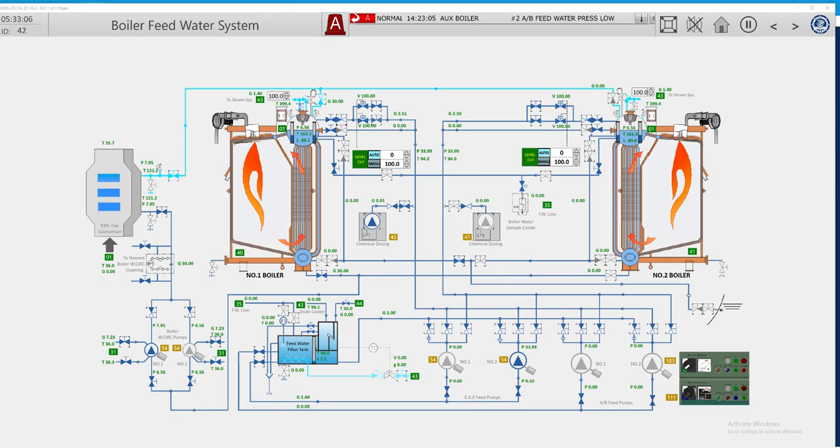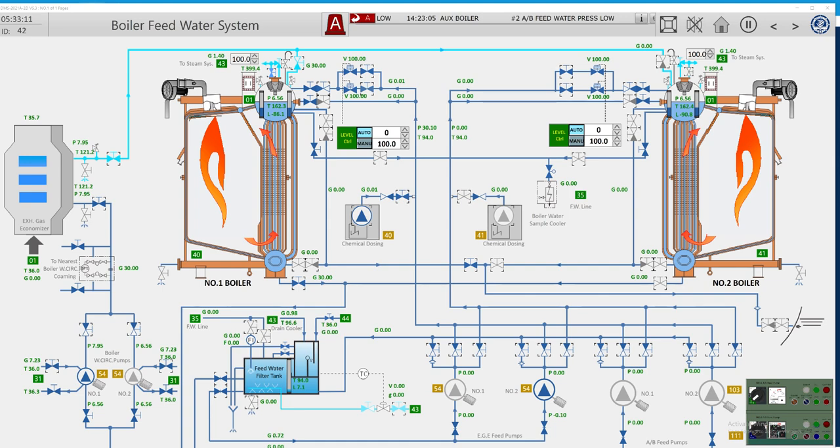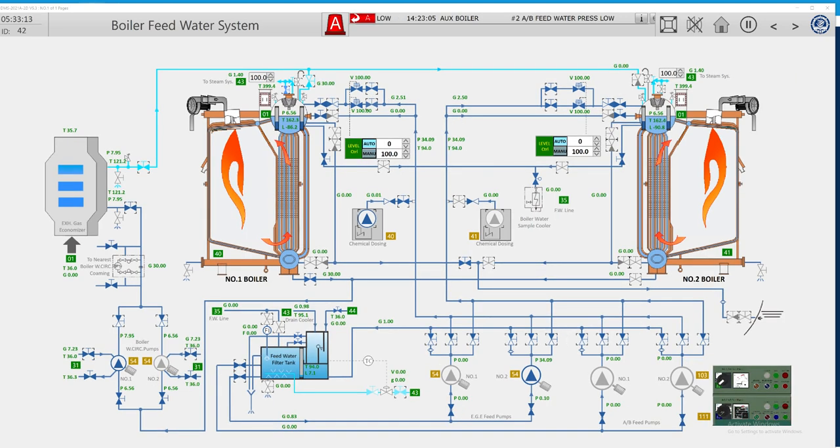The reason is that my pump here is running dry. It gets a pressure low, but I need to stop the pump so I will not burn it. We do not have any pressure to our pump. Also, checking the ampere meter, you will see that the pump is working without load — it's about one or two amperage.